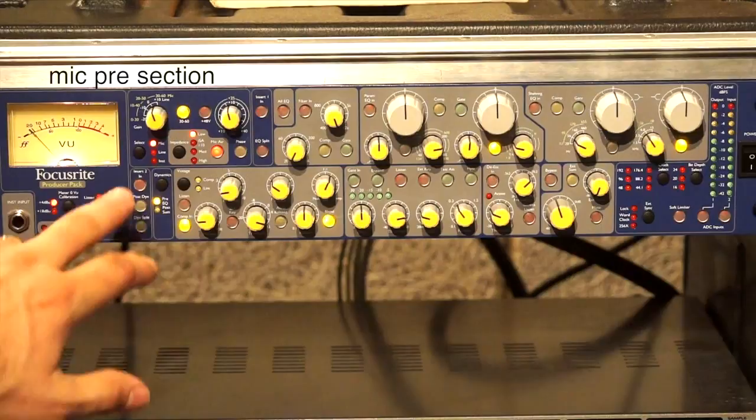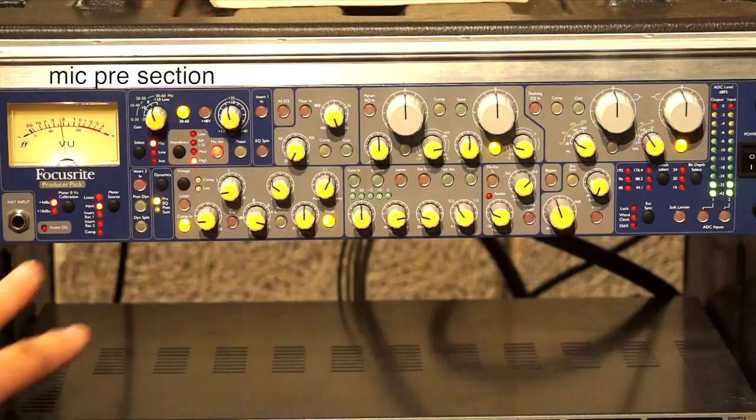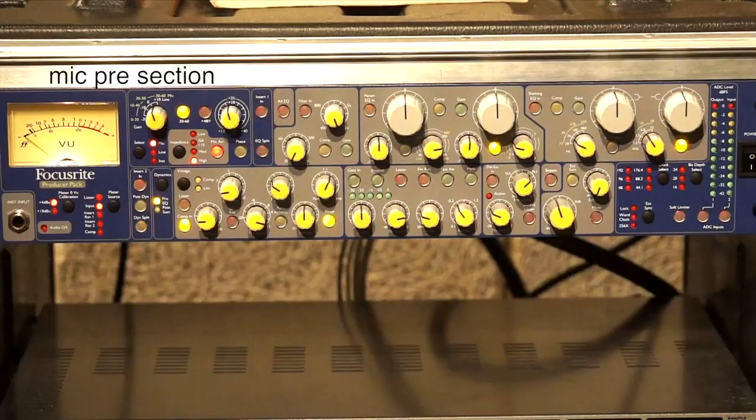Now I'm going to start stepping back toward the high. Here's my second setting, getting a little higher, and I'm going to go up until the medium setting, which gets a little higher, and finally we're going to go back up to the highest setting, which is the highest impedance, the brightest, clearest sound. This is all part of the preamp function, and this is a flexibility that very few other preamps offer. You'll never see that offered in a standard audio interface preamp.